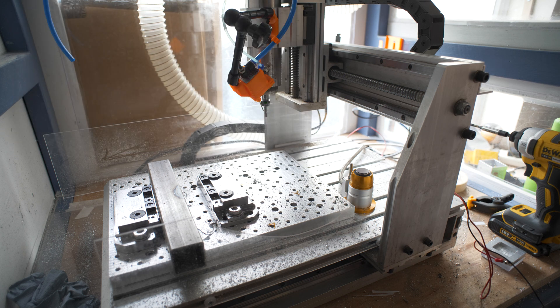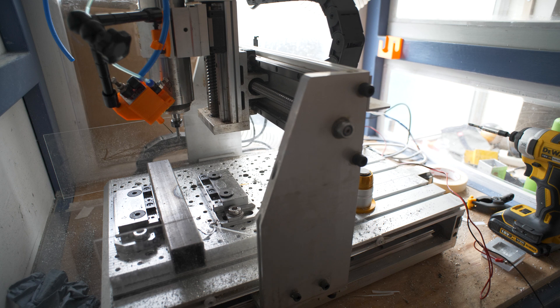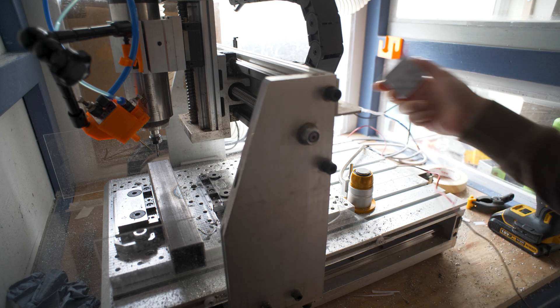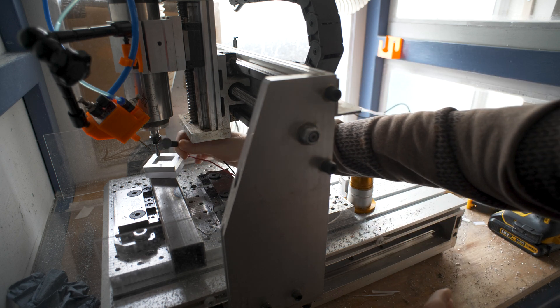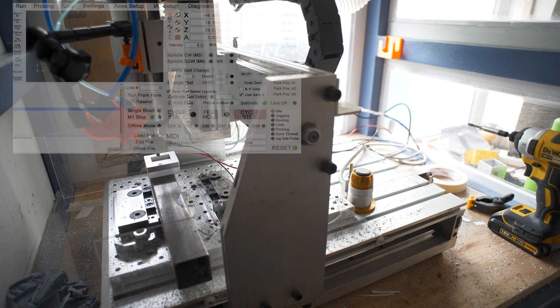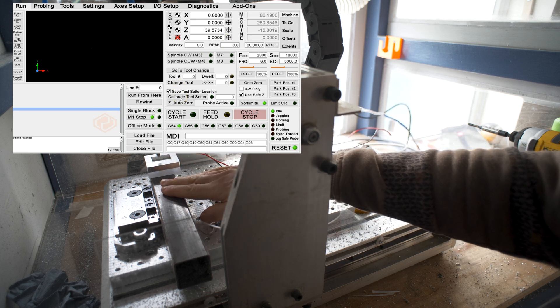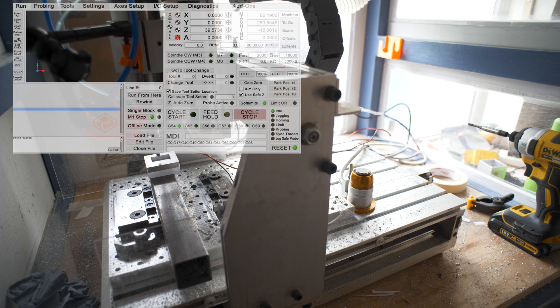The first thing you would do is move over to whereabouts you want your work zero to be. We need to get our touch plate and hook it up, put the magnet on, and let's say this is where we want our Z0 to be. We'll zero X and Y — let's pretend that's the position we need — and then we'll go to Calibrate Toolsetter. The first thing it's going to do is touch down on this plate to get the Z0 for the part, and then it will move over to the toolsetter and touch off there to get the offset. So let's press Calibrate Toolsetter.